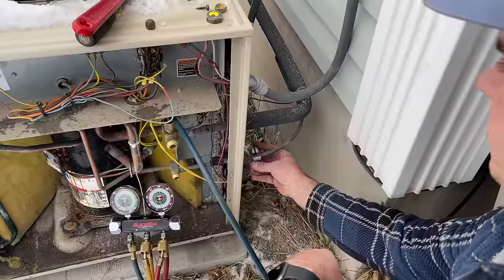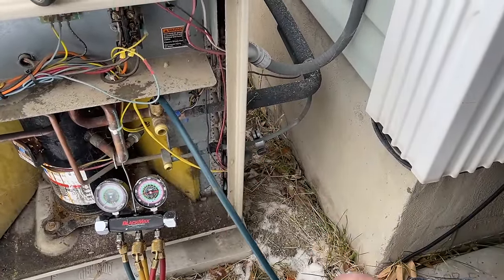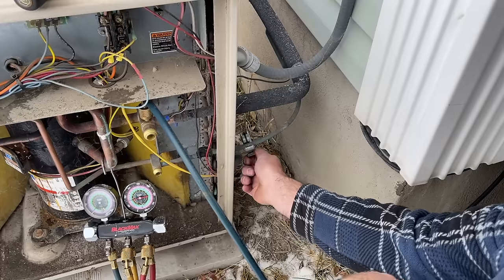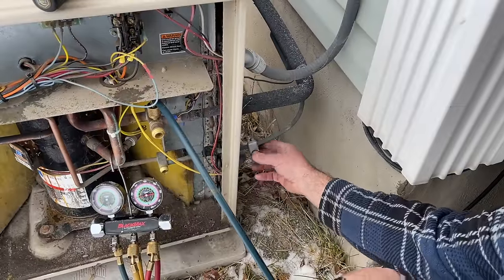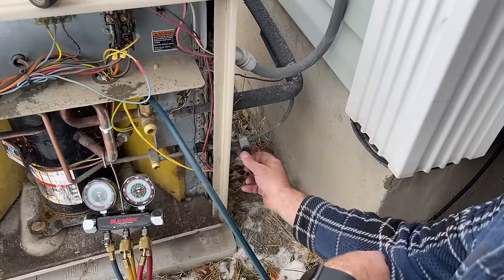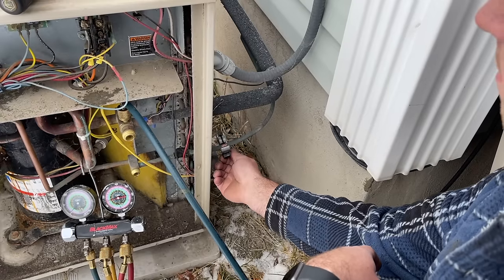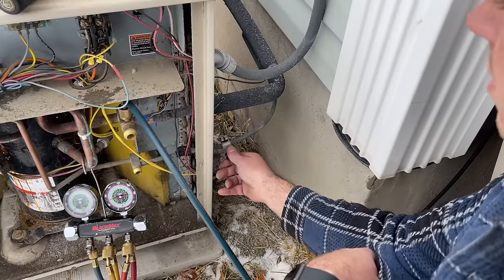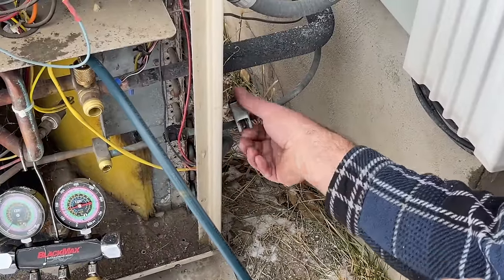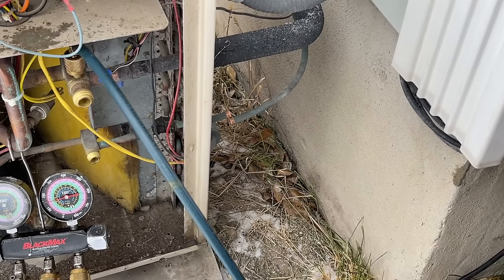It's as easy as that. Since we're just replacing the furnace today and replacing the condensing unit tomorrow, there will be a little bit of refrigerant in this line. So instead of having refrigerant leak out into the home, we're just going to cut this line outside first and then remove our coil inside. We're just spinning this a little bit, rotating it, spinning a little bit more — and it'll slowly cut through this copper line. There was actually nothing in there, so we're good to get our coil removed and replace our furnace.